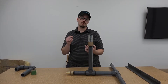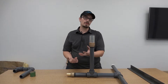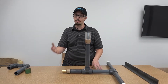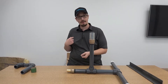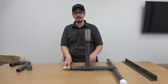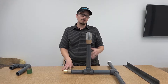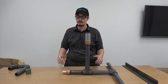When it comes to tying this into your line, I recommend in nine out of ten cases you use either poly pipe or spiral reinforced PVC suction line. The PVC reinforced is nice if you have to pull this out every year for winterization — it's a lot more flexible. For a more permanent installation that stays in year round, poly pipe would be great. Up here in north Idaho, these lines often have to be dragged up out of the lake and drained to prevent freezing. If you don't have to deal with that winter, you can leave it in year round — poly pipe is inflexible but super tough.